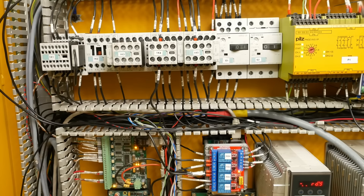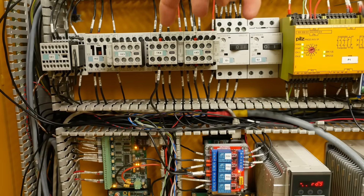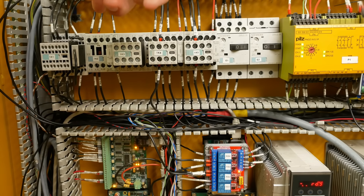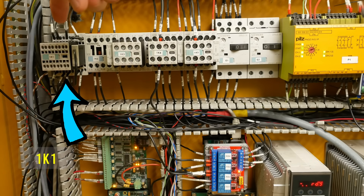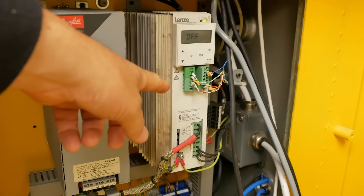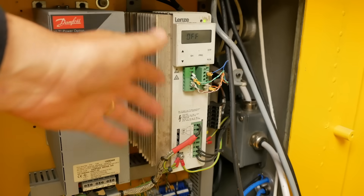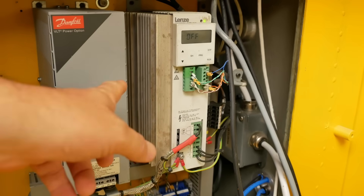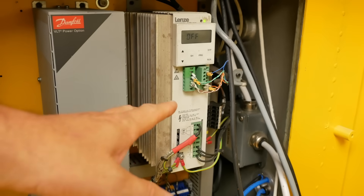The first question is: is it only these two contactors for the variator which can cause a problem? The main on/off relay when I first turn on the machine doesn't really matter if it gives a voltage spike because nothing else is happening at that time — either at startup or shutdown. This contactor powers only the main spindle motor indirectly, because it's powering the VFD, which does all the motor turning on/off and speed changes. That's well shielded with filters before and after, and I've had no issues with that system.